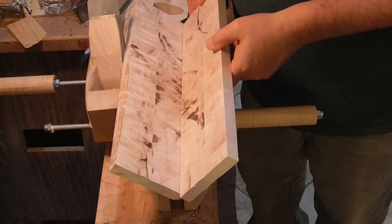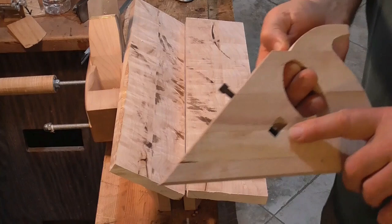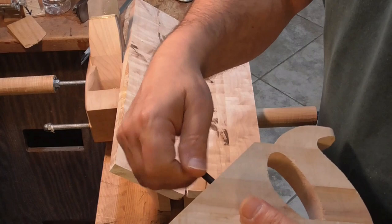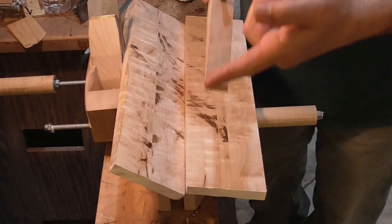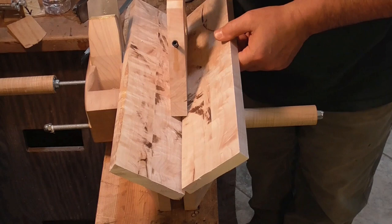Then I have the handle, the tote, and the tote is going to be shaped like this. This has a T-nut buried in it, and there's a hole bored through here, and I'm going to use this 1/4-20 screw to hold the blade in place. I'm going to pick a location for this, and I'm going to miter the bottom corner of this tote, so that it rests on, as I'm facing this, the left side of the core box plane.